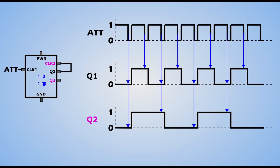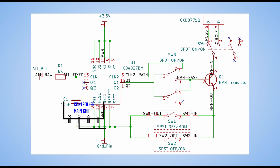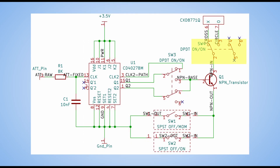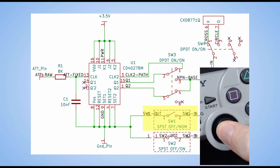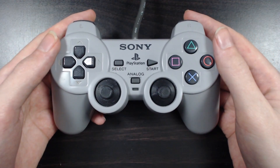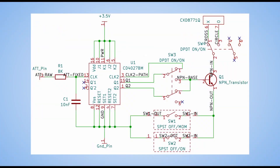And that's how the flip-flop utilizes the ATT polling line to press buttons. There's also a switch that changes between 30 and 60Hz input checks. In the current version of this mod, only cross and circle are included, because this was designed with Final Fantasy VII speedrunning in mind. There's another switch on the circuit board which allows switching between what button will have turbo applied — and of course this could be extended to any button by connecting to the appropriate pins on the controller chip. Switch 1 is a momentary on, meaning it's only activated while you're holding it down. Switch 2 is an on-off switch that latches and activates when you press it, and stays that way until you press it a second time to deactivate. These turbo buttons replace the analog sticks on the controller to avoid cutting into the shell and adding new buttons.